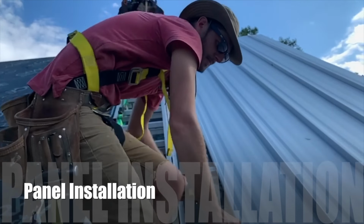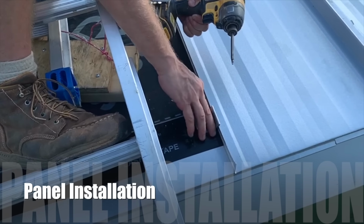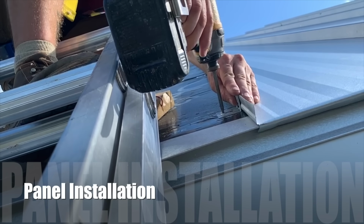So you have 2 clips within the first 8 inches of the bottom to keep that wind from picking up your roof. And then every 2 feet from there, you're going to fasten another clip.